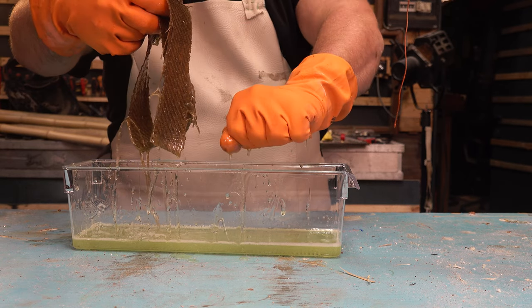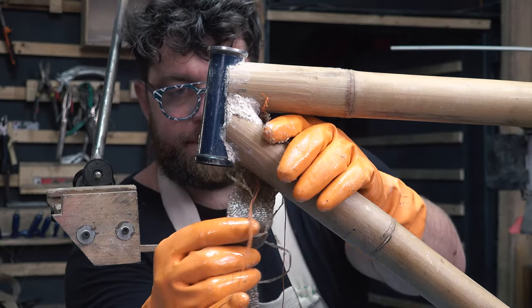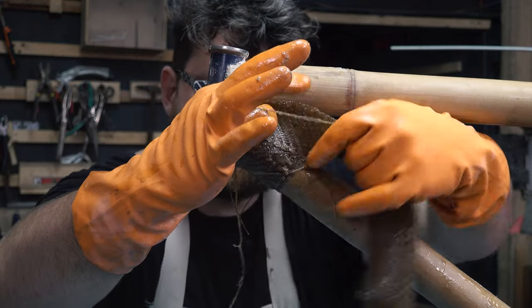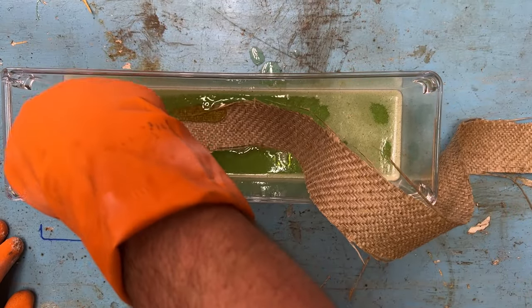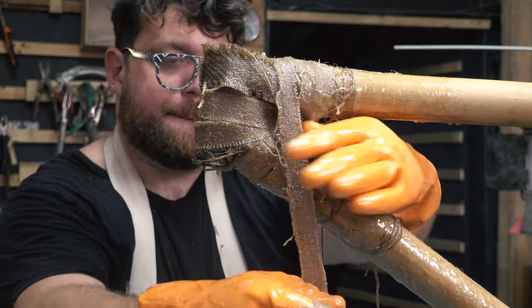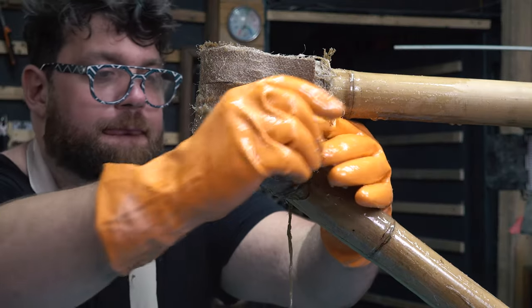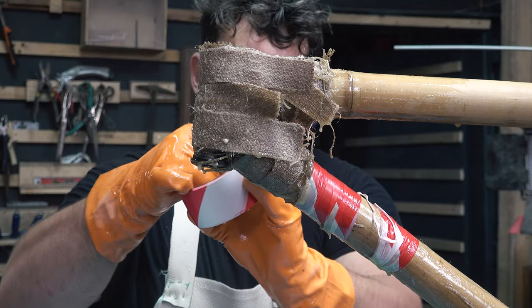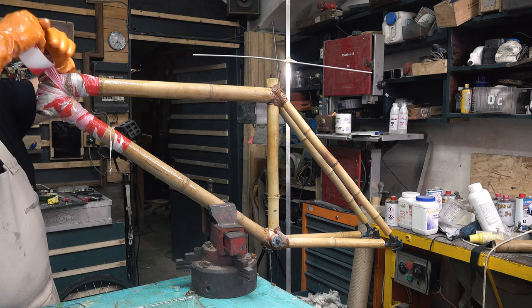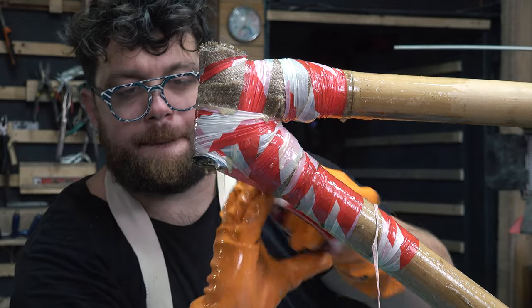Now it's time to install the wet fiber strips on all the junctions. There isn't a real technique, but I took inspiration from boxers who wrap strips around their hands to protect the bones. Push it and pull it all the way around the metal parts. A very important tip: cross the fibers every time — just like with carbon fiber or glass fiber, crossing fibers makes the frame much stiffer and stronger. That's why I also cut shorter pieces of fiber. Then squish everything carefully — you can use a vacuum bag or plastic tape pulled tightly around everything to remove air bubbles.